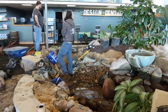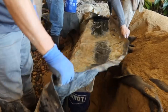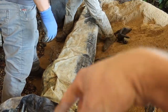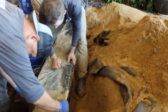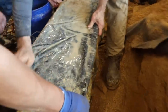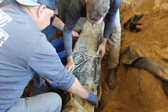Very similarly to what's happening over there, we are going to be cleaning up this liner. You can see the guys have a cut piece of plywood - they're going to drape the liner all the way across. We want to make sure that this thing sits nice and taut. They'll go ahead and use a scour pad or a Scotch-Brite pad to get all of that existing scale off. And then we will get it clean, dry, primed it, and then our double-sided tape, which is the three inch seam tape. By the time it's all said and done, it's about a five by 12 piece of liner that we're going to add on to this. Then we'll put a piece of six inch cover tape over the top of that, again ensuring that it's a nice watertight seal. See the guys really getting in there using that scour pad, getting all of that scale and build up off of there.